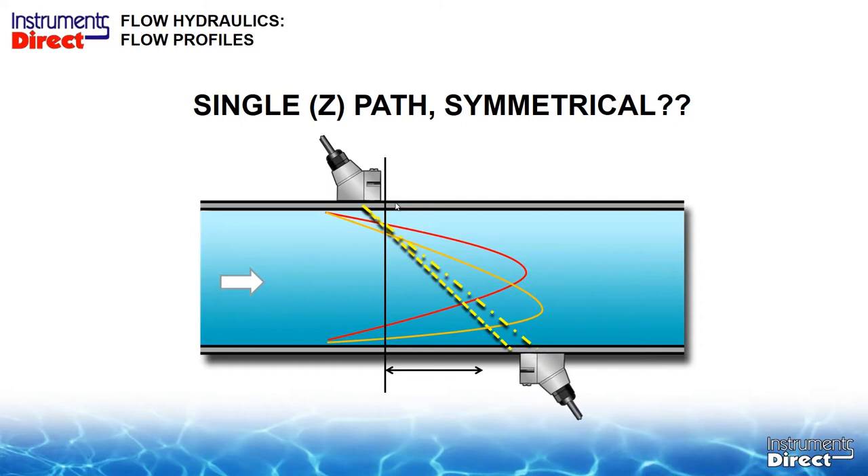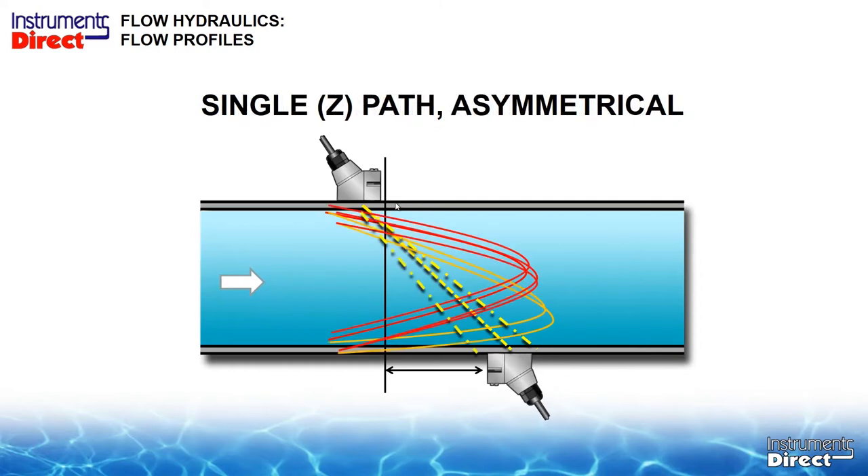The effect is clear: if you don't have enough straight run of pipe, you may have to go outside the box to get a reading. What if you had a short run of pipe and a wide varying flow? The flow profile can be all over the place — you may be able to get flow in the morning, come back to the same spot, and not get flow in the afternoon, because the flow profile changed. The point of injection across the pipe and the reception on the other side could be different. Lack of straight run of pipe can cause different flow profiles, different installation points, and affect the overall accuracy of the device.